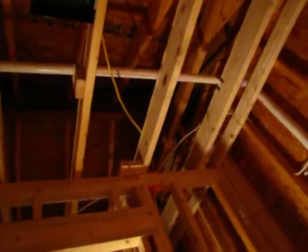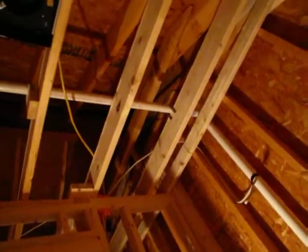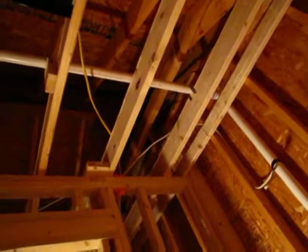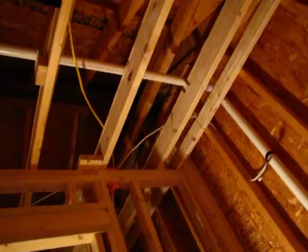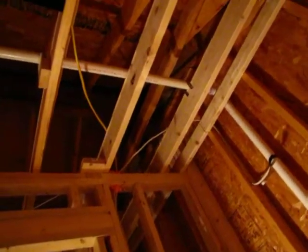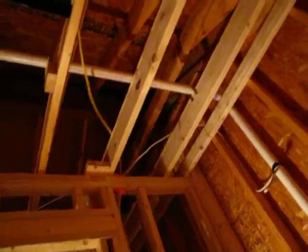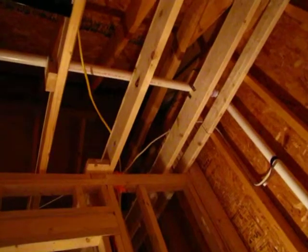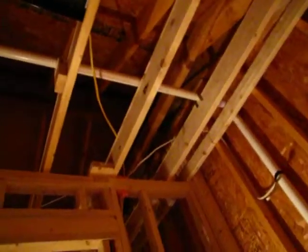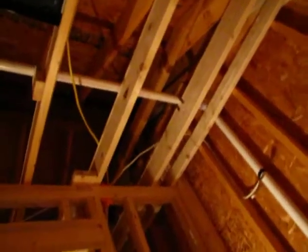What I'd recommend, and it's not that much more money, is what we call green board that's turned purple, because it's moisture resistant and takes a lot more humidity before it gets damaged. We were thinking of using Hardie Backer. You want Hardie Backer walls? You're going to tile the wall? No, there's no shower, so there's not going to be any humidity in here. Okay, that's fine, then we can use the standard $6.50 board. It's going to be used very infrequently, and it's just a sink.